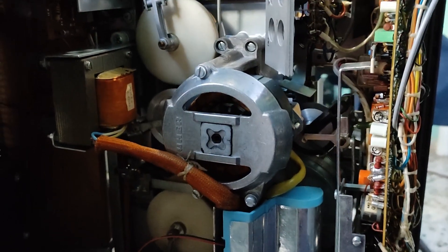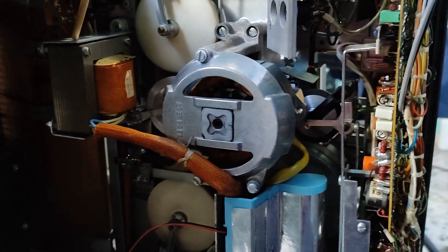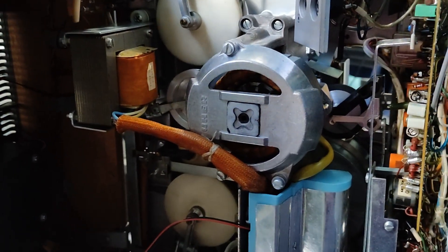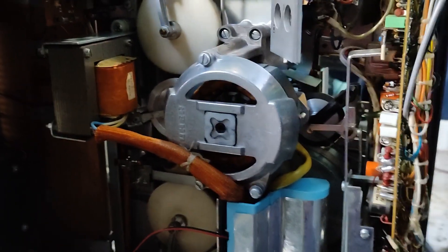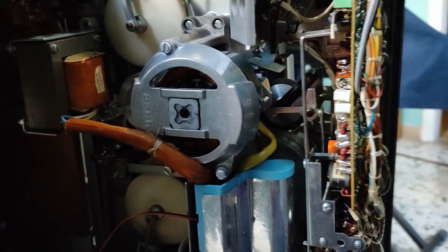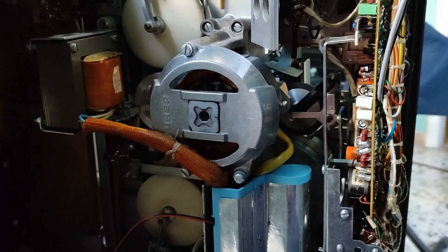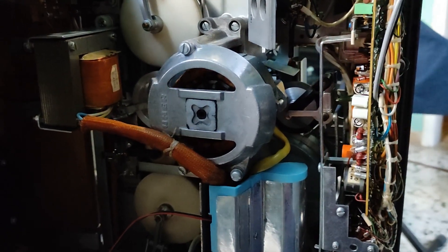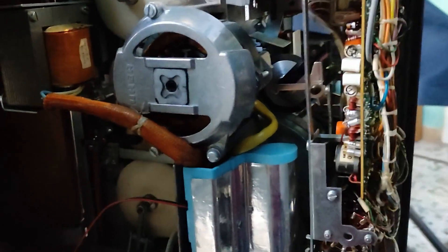That means I had to use a large capacitor and a large full bridge rectifier from the transformer, then a separate capacitor, and use another buck converter. All of this wouldn't be very easy to do, and I was afraid that the buck converter would introduce noise to the Arduino and all the electronics.